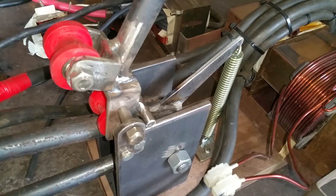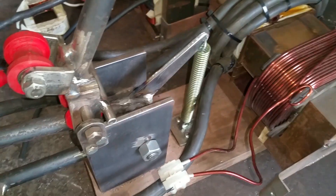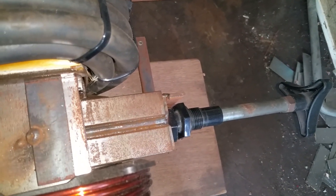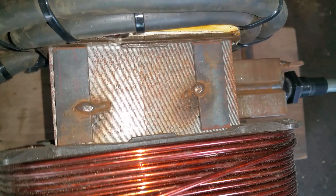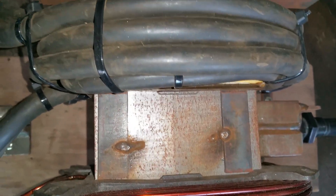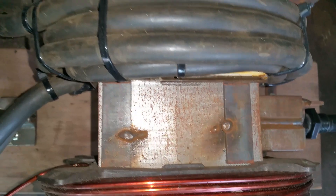It's fairly straightforward, just a bit fiddly to get going — all the stuff I made out of scrap I had lying around in my shed. At the back there is the choke — just a big block of laminated steel that slides in and out of the middle of the transformer. As it slides in, you're basically diverting the electromagnetic field to the choke so there's less going into the heavy-duty cable. So for light stuff I'll push it in, and for heavier steel to spot weld I'll pull it out to get the full amperage.